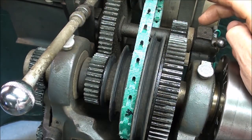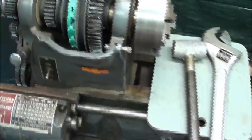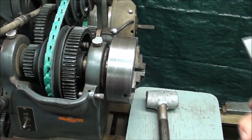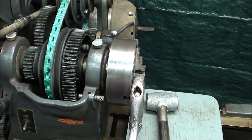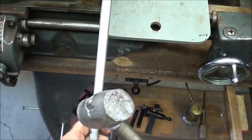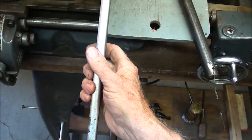You've got to be very careful because these gears are Zamak, and if you damage them or break a tooth off, you're probably going to have to sell or junk the lathe. What can damage them - and I've seen a lot of them damaged with no way to repair them - is when people remove the chuck using a very large crescent wrench on the jaws and then beat on it relentlessly with a large hammer. That can very easily knock a tooth out of the gear.